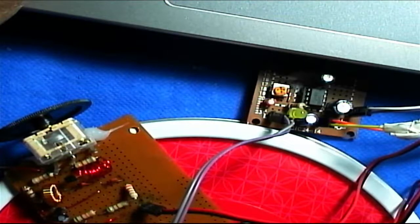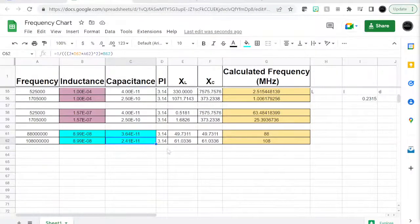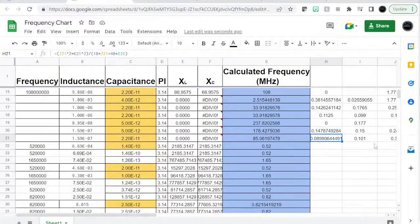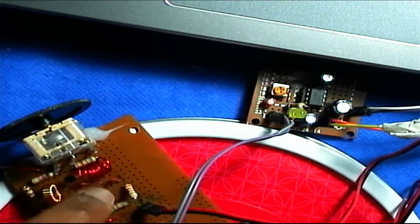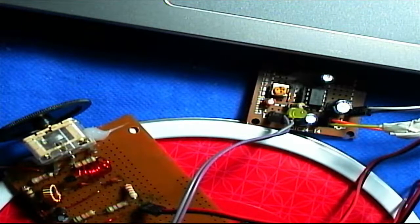So to summarize what we did: we plugged in the values — the inductance was originally 0.0891 from 0.103 length, and then remeasured exactly at three turns giving 0.0899. We took that value, plugged it in with the correct units, and we're getting about 24 to 36 picofarads. If you move the decimal point appropriately (pico is 10^−12), same result: 24 to 36 picofarads.